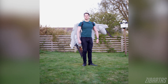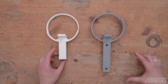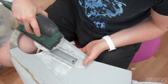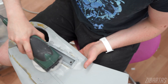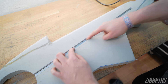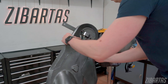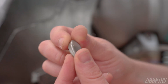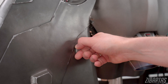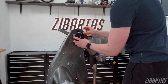When it came to wing mounting, the first version was not reliable enough. That's why I elongated the sticks of the mounts and then epoxied in a 3D-printed socket into the wings so it would slot in perfectly. This also improved the rigidity of the wing, supplementing the aluminum rod that was already there. To keep them in place I used bolts to clamp down the wings to the mechanism, tightened with wing nuts that I designed to look like they belong there. The only way these wings are coming off is if you rip the bolts out through them.